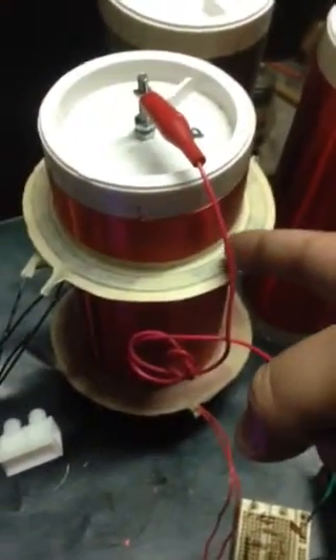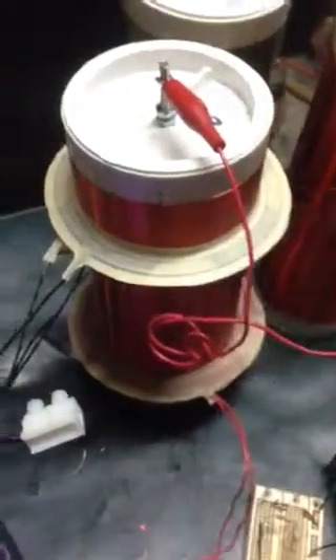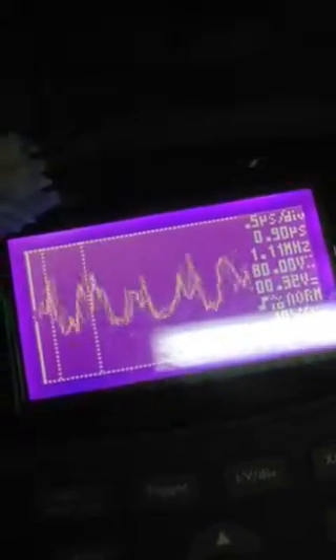What I do now is bring that back into oscillation — I take my finger and I bridge the gap here. I touch this top coil and I touch that coil, and I let go. Then look what happens to the waveform: it jumps back up to that 1.1 MHz, and it gains amplitude in terms of spikes and peaks.